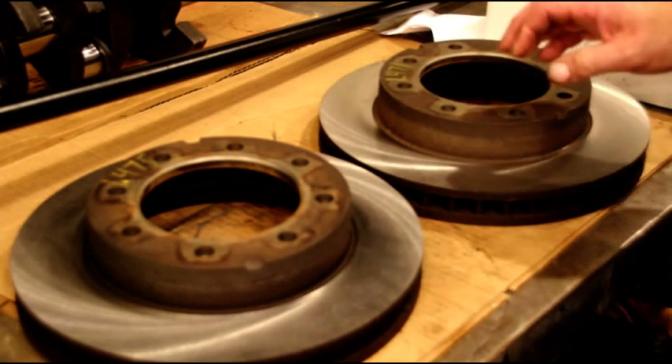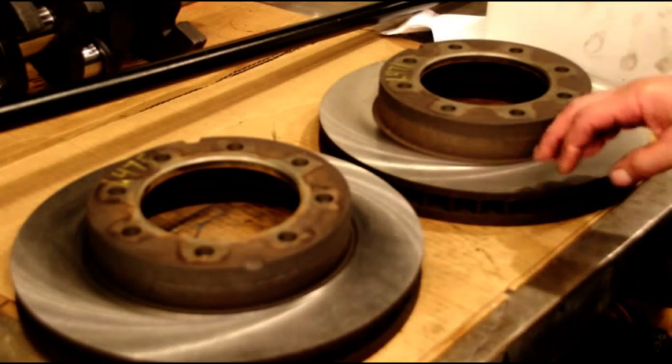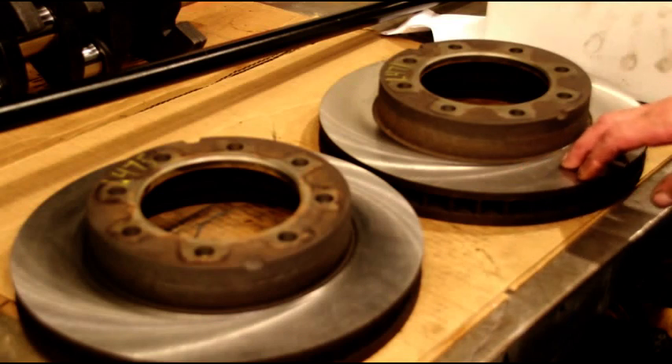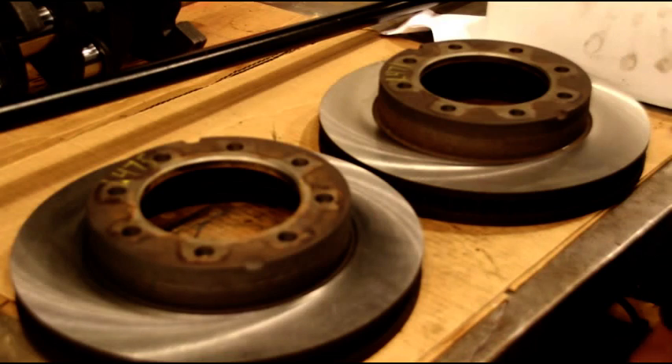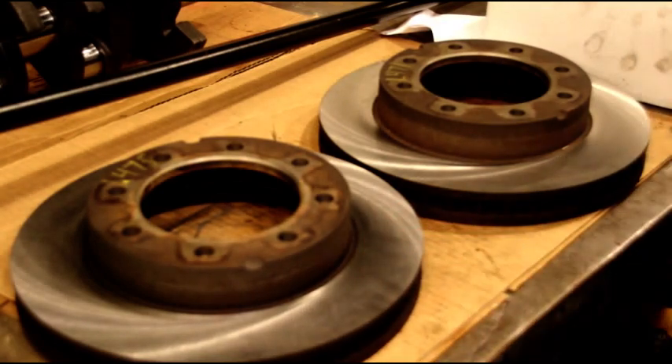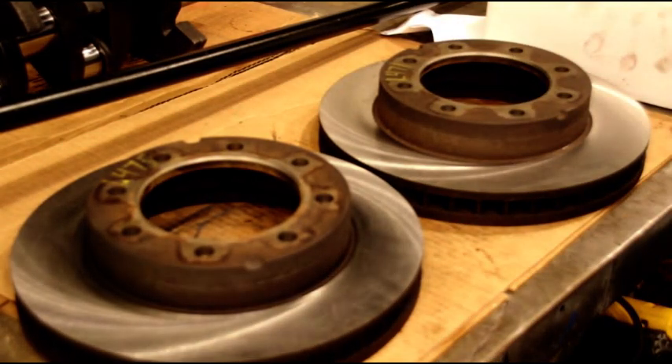This particular one had some hot spots because the caliper was sticking — it's easier to grind through hot spots than it is to cut on a brake lathe. I just want to show you guys another way of getting true, perfect rotors. You can do them on a flywheel machine and you can see how they come out — perfect. We'll take these, put some preservative on them, put them in a bag, and they'll be on the shelf ready to go for the military pickup. If I ever need them, they'll be here and I know the braking will be perfect. So that's all I have for today — if you've got big rotors and you can't find anybody to do them, maybe take them over to your engine machine shop, put them on a flywheel grinder, and they will come out absolutely perfect. Thanks for watching — catch you on the next one.